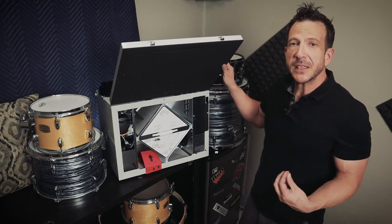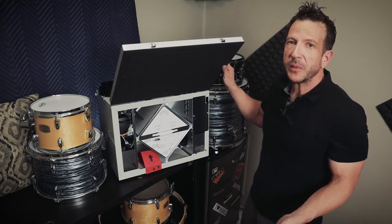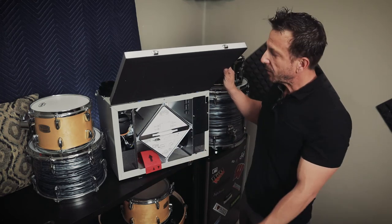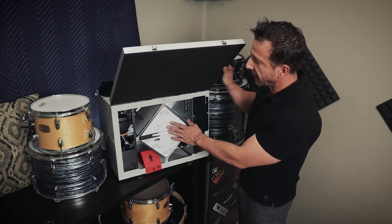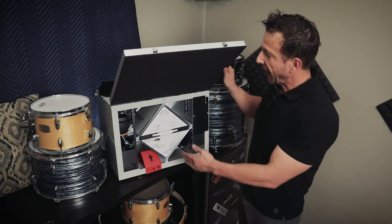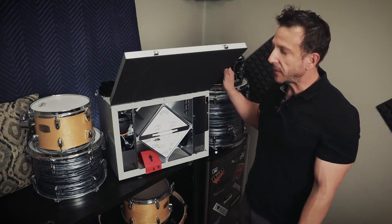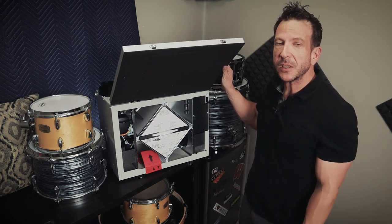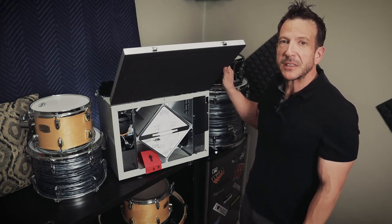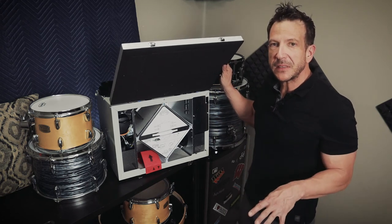So I live in a desert climate, and in the summer, it's very hot here. It could be 115 degrees outside. It would be very uncomfortable if I had a bunch of 115 degree air just coming into my space. But what this does is it's going to have a heat transfer between the air leaving the space, which is hopefully a nice, comfortable 75, and the air going into the space, which could be 100, 110. This thing is about 60, 70% efficient, so it'll get about 60 or 70% of the way between 120 and 75 degrees. And basically the result is you are ventilating the space.